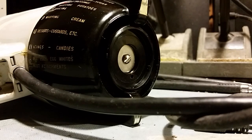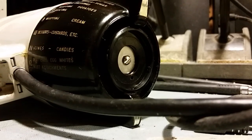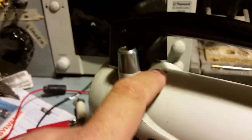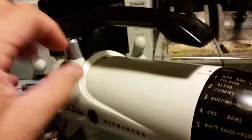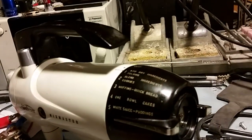Low speed is good, high speed smooth. It's not a modern AC motor controller, but it's 50 years old and will probably last another 50 with a little maintenance. For the lubricant — right here in that hole, and that hole a little bit right here. Some of it came running back out of this area, so wipe it down. After you lube it, make sure you spin it for a minute at full speed.